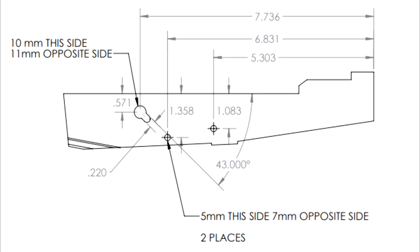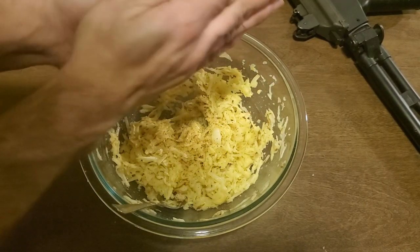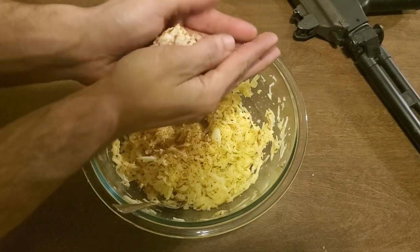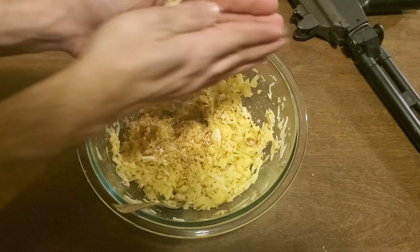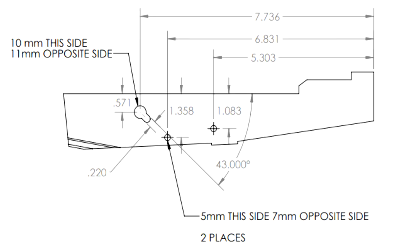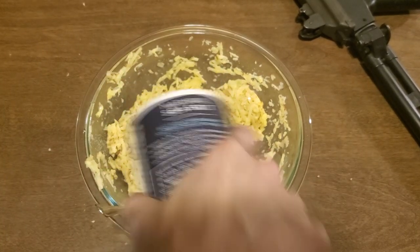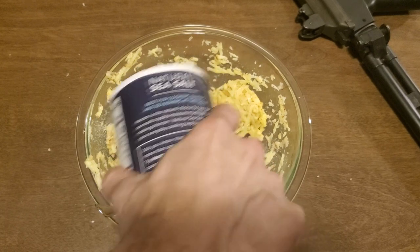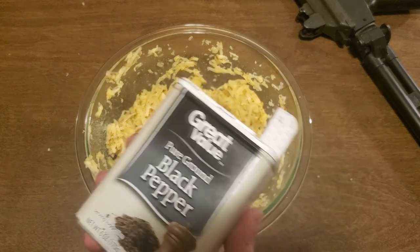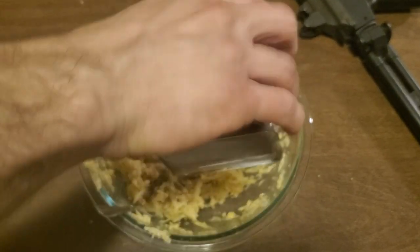The blueprints Tordort has on the website have some weirdness to them. They aren't bad prints. I followed them close enough and they worked fine. But some things are just odd. First and foremost, the receiver was warped. I didn't think to take footage of it, but looking at the prints, you're supposed to zero off the top rail and from the front of it. The front was fine, but the top rail was bowed in about 15 thousandths in the middle. Obviously, when Tordort had heat treated it, it had warped. When you get metal red hot and quench it, you can expect a little bit of warping. That isn't Tordort's fault, it's just physics.